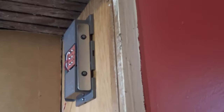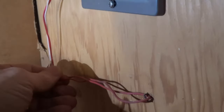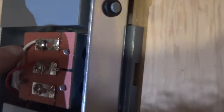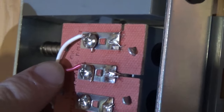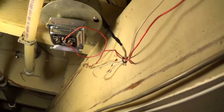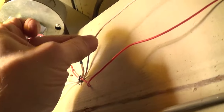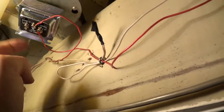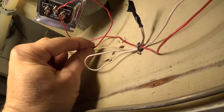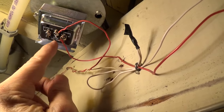You can see where I installed the chime — it's in an upper cabinet right here, because the existing wires were right there. There was a red and white coming from the transformer, plus an extra one that used to go to the back door. I wired the white one to the front door terminal and the red one to the transformer. After I test it out I'll go ahead and put the face plate on. At the transformer, I essentially joined the two white wires — the one coming from the doorbell and the one coming from the chime — together, so it basically bypasses the transformer. The red wire from the doorbell is connected to the transformer and the red wire from the chime is also connected to the transformer.